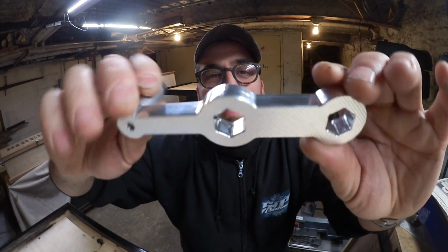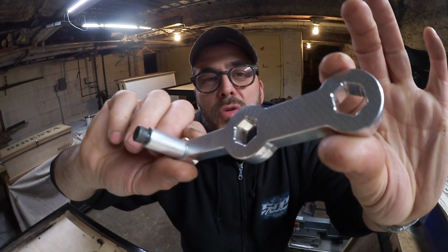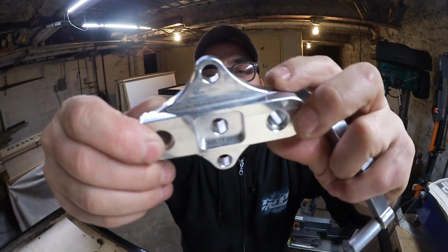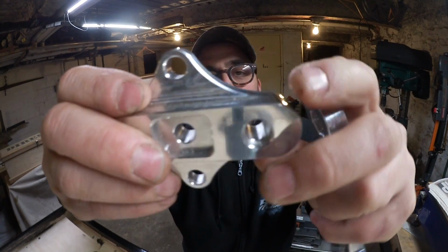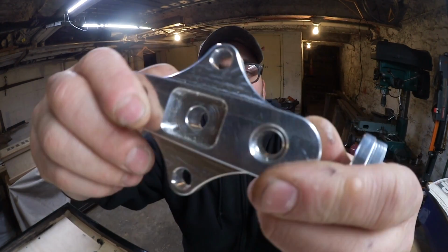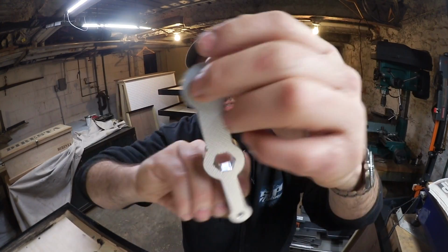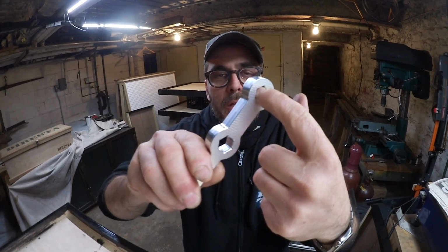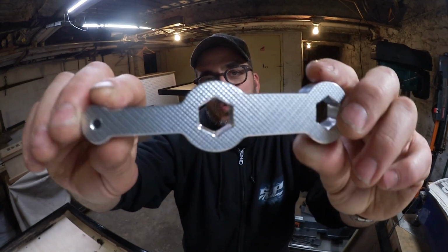Check it out. I got a chance to learn how to use Fusion and the Tormach together. We made these parts. This particular part was really just an excuse to utilize a couple of different techniques on holding stuff in the vise and machining both sides. This is actually a vise. It's called a speed handle. You can go here quickly and then you could wrench down on something with a little bit of leverage. So this is for the 4-inch vise for the Tormach.